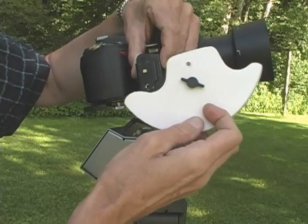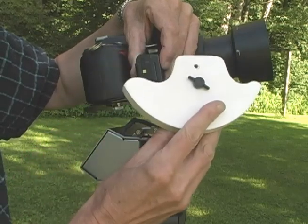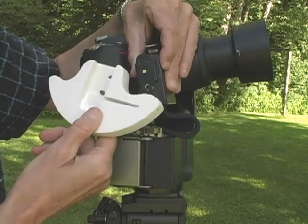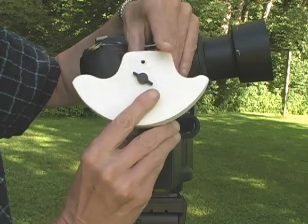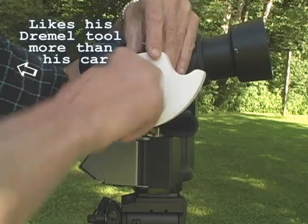The cam is made of PVC. It's shaped from a 1x4 PVC exterior trim board. It's hollowed out in back to fit snugly over the camera tray and button pusher. So all it needs to be attached really solidly is a single thumb screw, replacing the shorter one that adjusted the button pusher height.